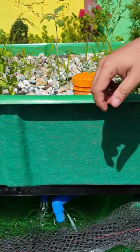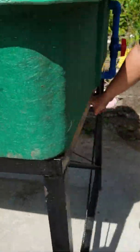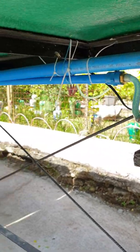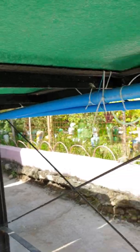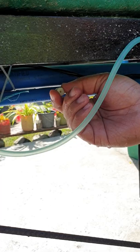For additional aeration we have air stones, powered by this small compressor over here. This small compressor powers the aeration system through a manifold. These are the manifolds — you control the level of aeration by controlling these valves.